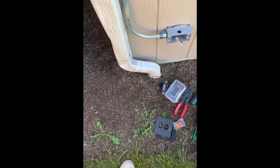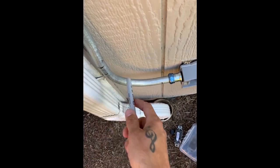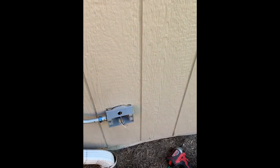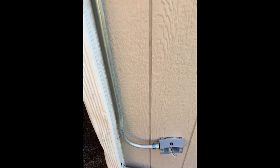So we gotta make sure when we got this on the floor, the 90 degrees is coming up towards the ceiling. That way we'll have that mark and we'll bend it up towards us. So 45 degree going that way, coming down, and the 90 going up towards the ceiling as well. So let's go bend that and we'll come back here and just cut off how much we want. Put that electrical box up, connect it, and then we'll pull the cable through.